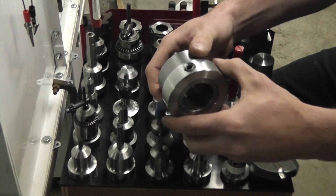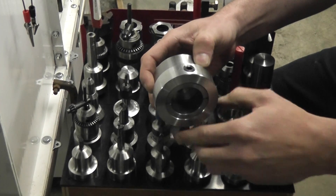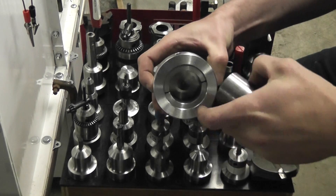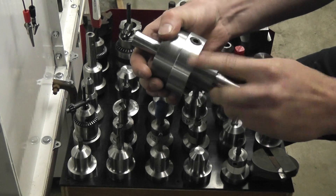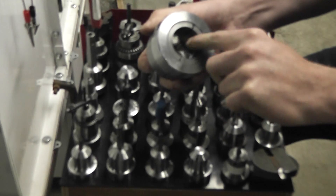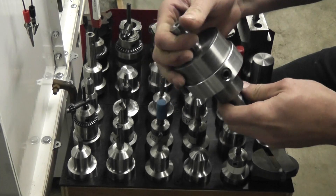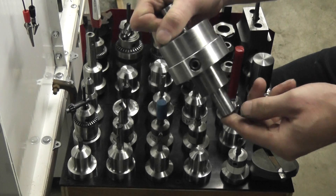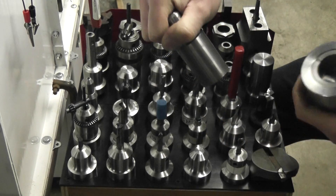It was machined pretty much just like the tool holders. This ring here is the type used for holding a bearing in place on machinery or farm equipment — I got it at the farm and home center; it's for a two-inch shaft. I machined the hole to fit my round stock, so you just tighten up the nut and tighten up that set screw. I cut some slots in there to pinch the stock, so it fits in the collet. You machine this end out, put another piece in, or if you're just doing one or two you can machine it, polish it up, flip it around, and finish your tool that way.